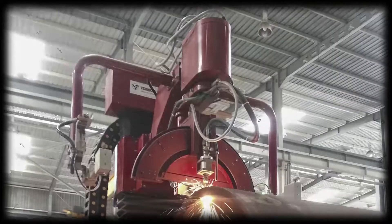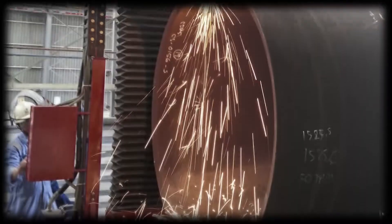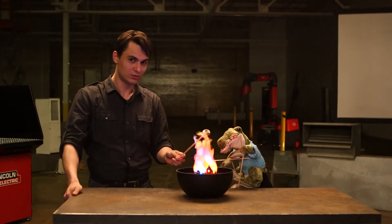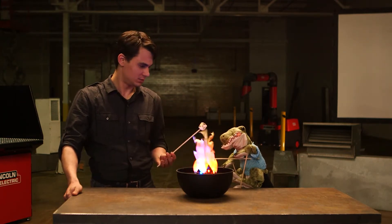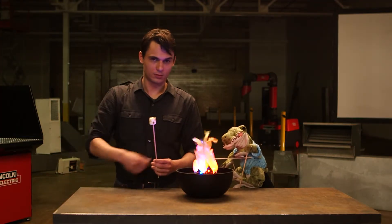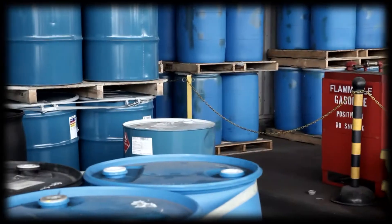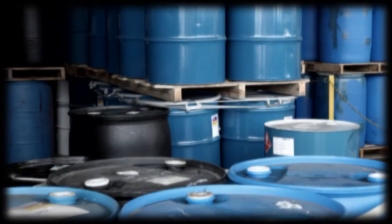Next up: fire and explosions. Fire and explosions can be caused by hot slag, sparks, an oxygen-fueled cutting flame, or a plasma cutting arc. Do not work in an area where combustible or explosive gases or other materials may be present. Remove or protect any flammable materials, and ventilate any explosive or flammable vapors or dust from the workplace. Don't cut or weld on containers that may have held flammables or combustibles.